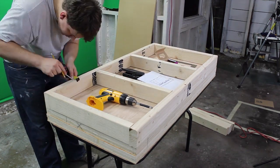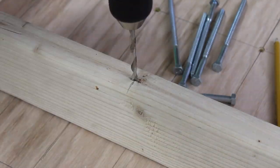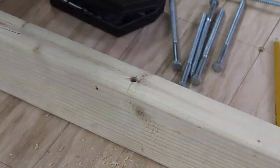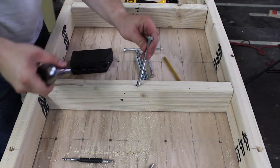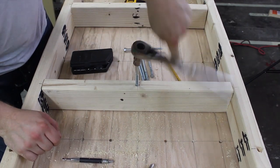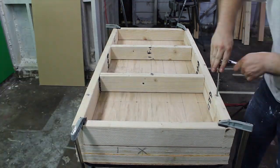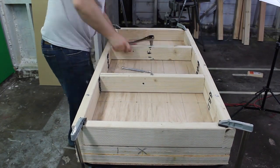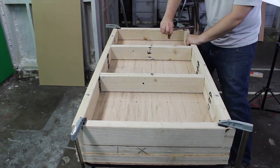Pop it down and you'll have 2.5 inches in the bottom of that 3-inch top. I'm marking out between the studs and then one in the middle of each of the runners as my spot — you can add more if you want. I used 3/8-inch lag bolts, so drill out the hole that's required. I screwed up and used the wrong size at first, then got it right. Just check your bolts and make sure everything is cool. Use the largest ratchet you have for more power and leverage to pull the lag bolts in faster. Because I used really decent plywood and not particle board, I didn't have to pre-drill — I could just stick the lag bolts in and shove them straight through. This is the most effective way to connect the top and the bottom, and if at any time I want to move or change the top, all I have to do is just unbolt it. This thing is modular and easy to use.